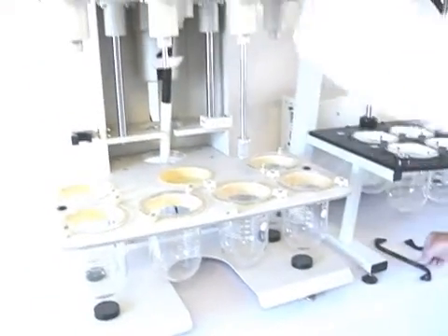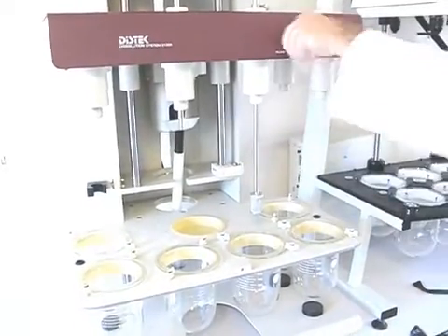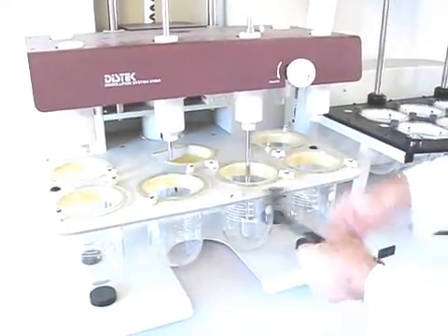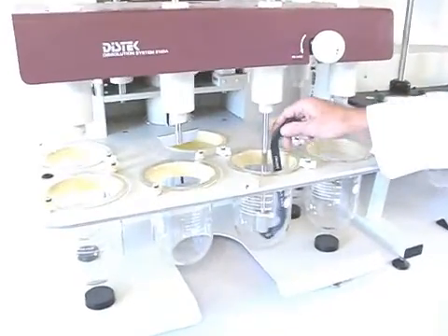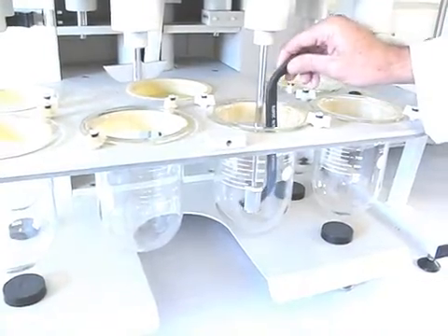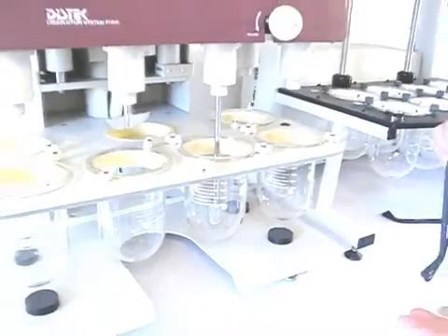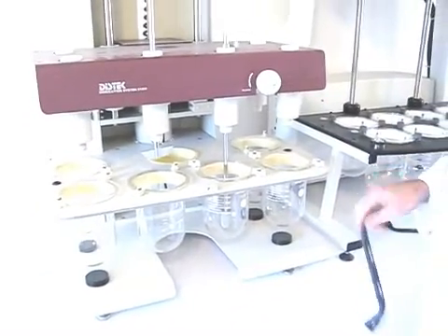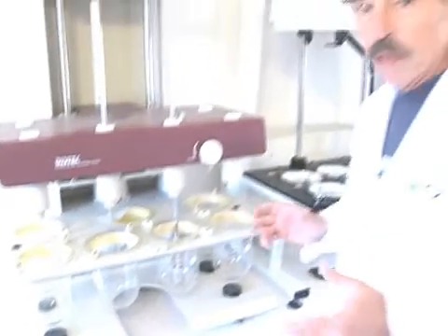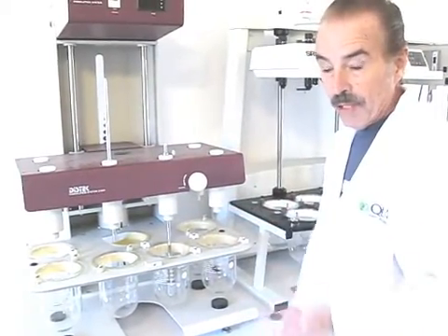As long as you've got the collar stopped here and you're using the stop, go back to this position and we should be able to verify with the go/no-go gauge — starting with the go, yes, it does fit under very easily — and quickly go to the no-go, and nope, it doesn't fit underneath. Again this unit meets USP requirements. I don't know the exact number, but it's within the two millimeters, which is all it has to be. If you want a more accurate answer, you can use the digital depth gauge and you'll get an exact, very accurate reading and know the exact number.